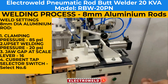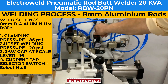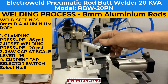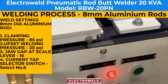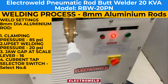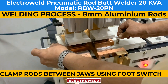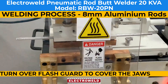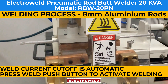You can set the clamping pressure to about 85 psi, the welding pressure to keep at 20 psi, the gap at scale at 16, and the current tap at tap number 6. Then clamp the rods, put them in the weld and put the press rod all the way. Press the welding switch. See — this joint is welded. Keep the press rod out.